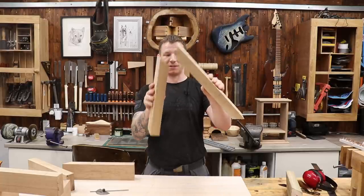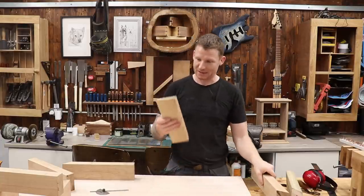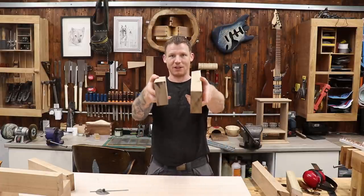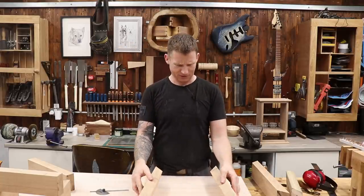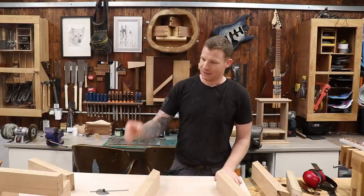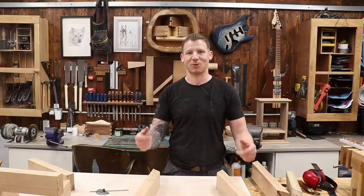The top piece is now too short so I have to make another one. The other pieces I can just flip around and put the two 50-degree angles to the bottom. Now I need to cut at 40 on the piece, which actually means setting the mitre saw to 50 degrees — which is very strange and I'm still struggling to get my head around it. So I'm cutting all these at the opposite angles to what they need to be, to end up with the angles I actually need.